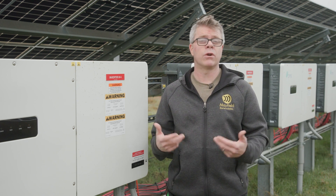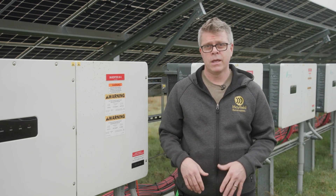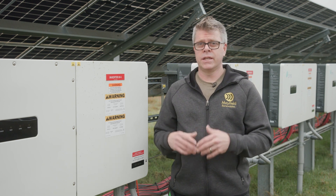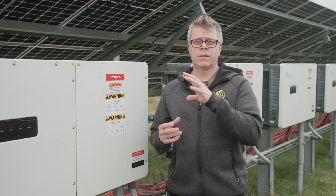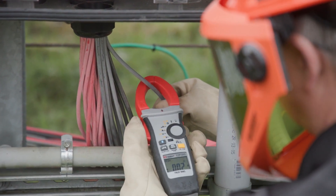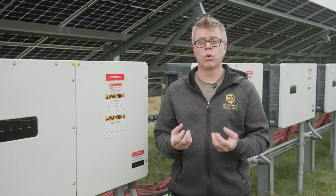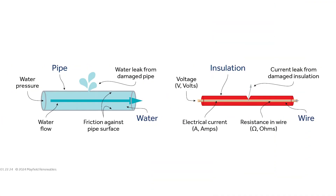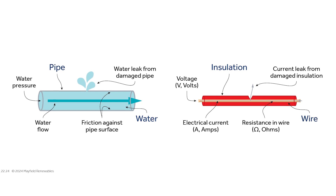In order to maintain or fix any conductors — as the name implies, an insulation resistance test looks at the different circuits and the conductors to make sure that the insulation around the wires themselves is in good working order. We very often use water as an analogy in our electrical systems, and this is a lot like pressurizing a water pipe and looking for a leak.